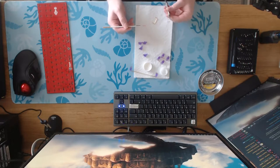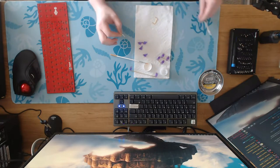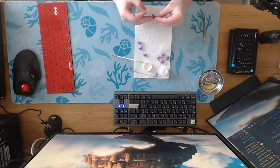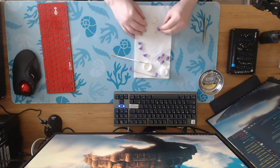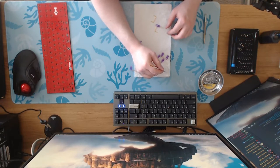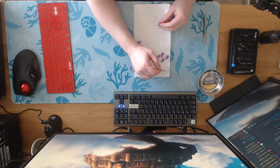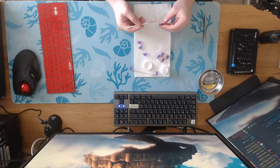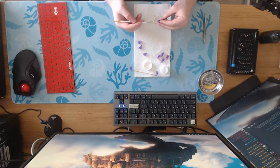What is your daily driver? I don't really have a daily driver. I rotate through boards pretty frequently. This answer changes every time I get asked, but right now my quote unquote favorite board would be my Cura 80 TKL. I have a Suo TKL PCB in it with Milmax sockets installed, and it's built with MOVs lubed with 3204. I've been really enjoying that lately. But I probably don't go even 2 days without swapping out my keyboard.